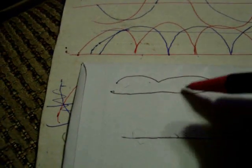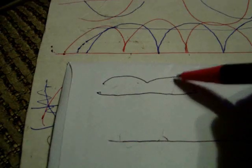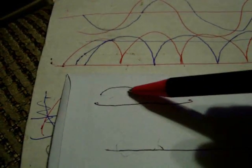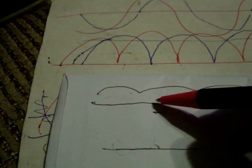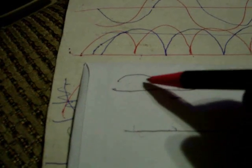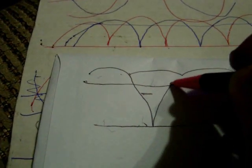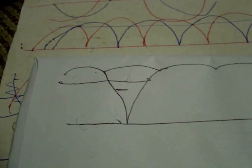It'll be above your battery voltage. If this is 12 volts or 24 volts — whichever you're using — this is the voltage above, however many volts above your battery voltage as you're charging, is the voltage that creates the amps going into your battery. If your voltage is down here, the diodes are in line and nothing's going into your battery — nothing's coming from the battery going to the wind turbine. When the voltage comes up above your battery voltage, that's charging. None of it is going to zero. If I was on a single set of coils, it would come down to zero and back up; you'd only get this much charge, then this much charge. This charges all the time — this is what's good.